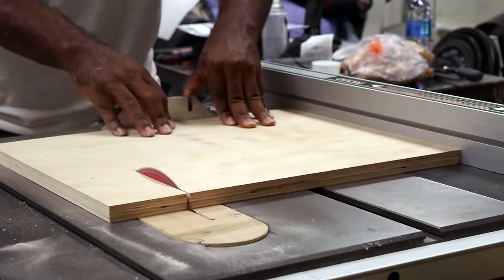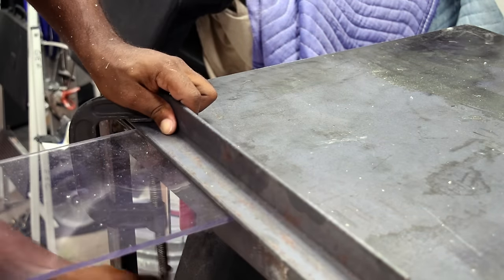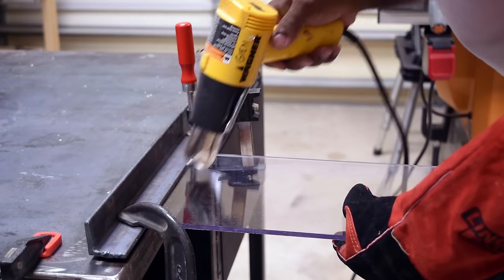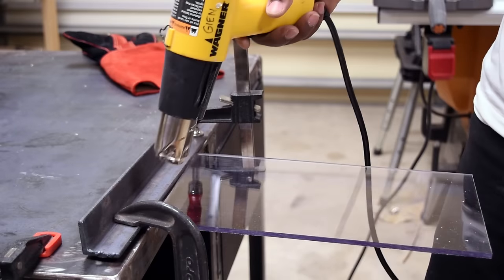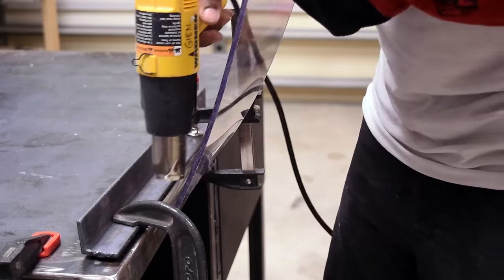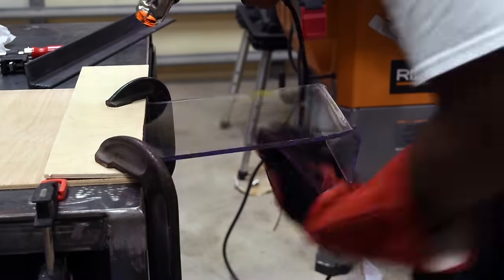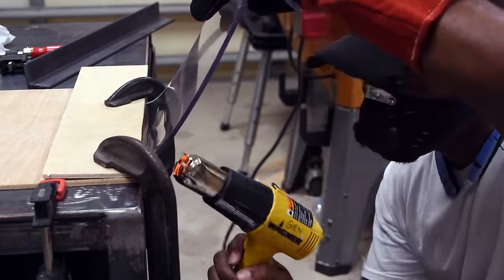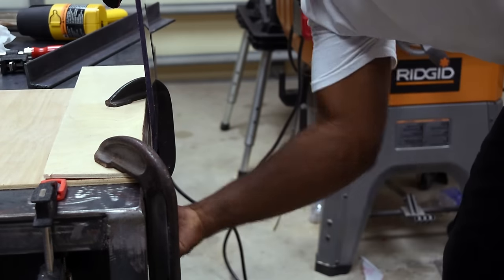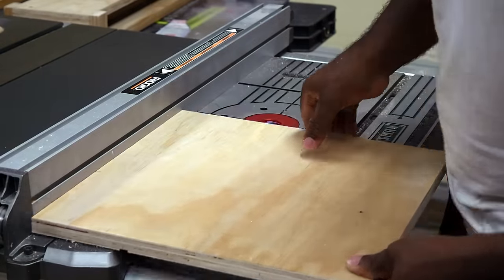Now to cut out the bottom and the top. To make the shoe stand I'm using a piece of plexiglass which I'm going to bend with a heat gun. It's really important to use a pair of gloves — I'm using welding gloves to withstand the heat because the plexiglass does get hot. It takes a while to heat up, and you want to keep the gun moving at all times to help prevent the glass from developing bubbles on the surface.